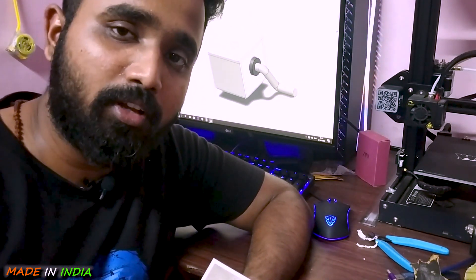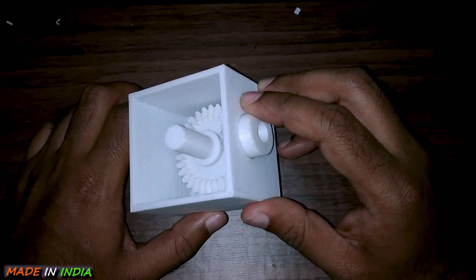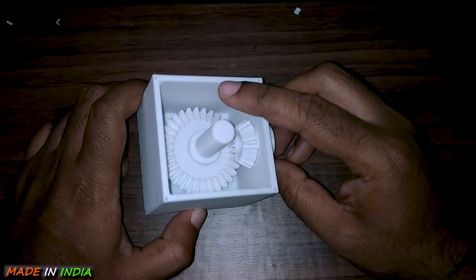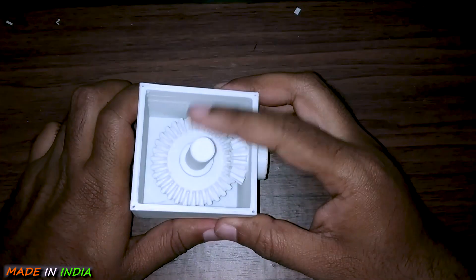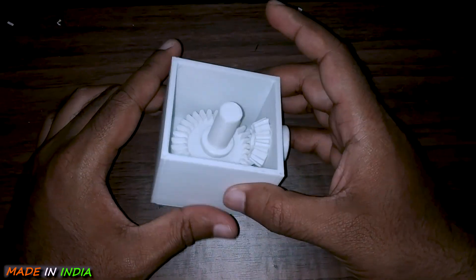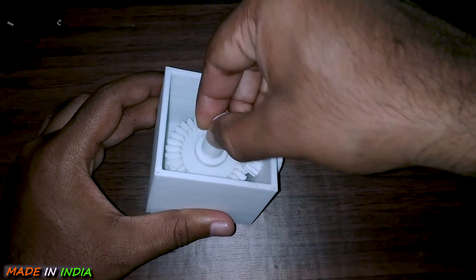Let me now explain what I was talking about earlier regarding the bevel gears, using this demonstration. Let us categorize the two wheels: the first gear is the driver gear and the bigger gear is the driven gear. On the driver wheel, the teeth are 16 in number, and on the bigger gear it is 32. So if we divide 16 by 32, it is 1/2 — the gear ratio is 1:2. This means when you rotate the smaller gear by 2 rotations, the bigger gear rotates by 1. The torque on the bigger gear is much higher and a high force is required to move it. This is the only reason I am using gears — they do not transmit any backward forces. If you rotate by the driver wheel, it rotates; if you rotate by the driven wheel, it does not rotate.